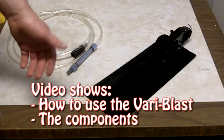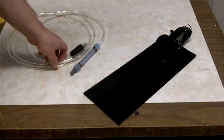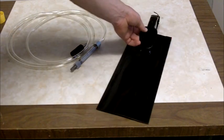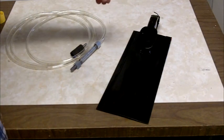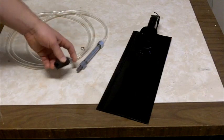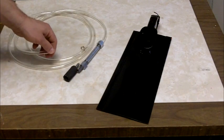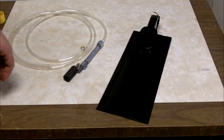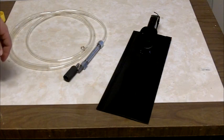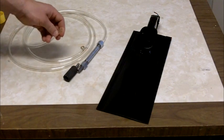In this video I just wanted to show you a little bit about how it works, but first I want to share a little about the components that come with this kit. First you have your foot switch device, which controls the opening, closing, and variable pressure of the sand coming out of the nozzle. Then you have an adapter kit which converts it to a smaller tube than the standard one that comes with your sandblaster — I believe it is about a half inch. Most people sandblasting in their cabinets or on small components usually don't need that large of a tube.